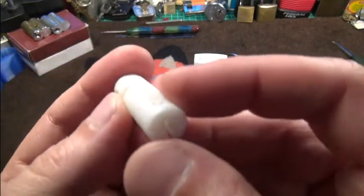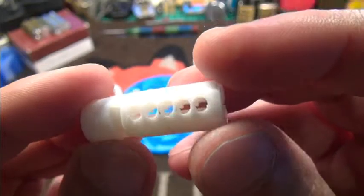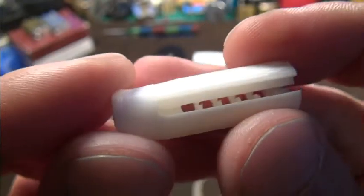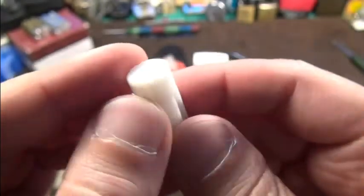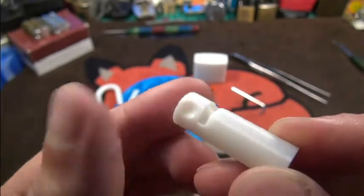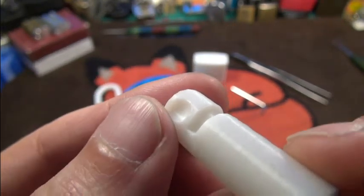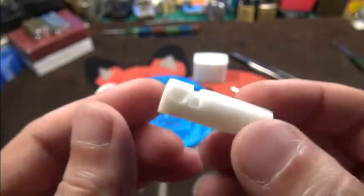And you can see this accordingly on the plug — pretty cool. I think I printed this standing upright; it came out very nice. I only had to clean up the hole slightly, and you can see even a little bit of warding inside. It was relatively hard to design, but it worked out. I only had one other prototype, which I'll show you in a second. The left side, which goes to the longer shackle end, is a little bit shallower so that the bigger ball bearing cannot retract completely and holds the shackle in. And here it is deeper.